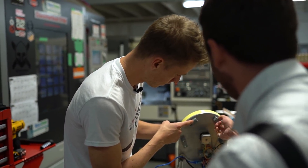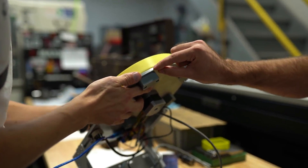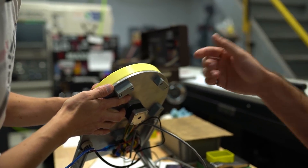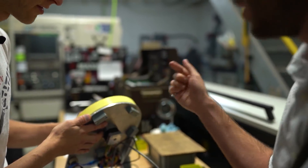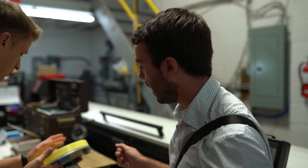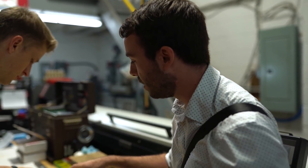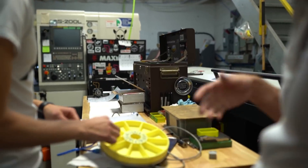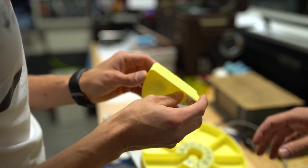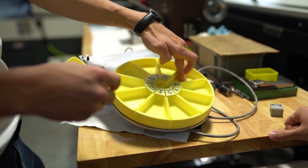So what are these again? These are bearing mounts. They hold very common 608 bearings — just like a skateboard bearing. And it just supports all the outside. There's five of them spaced around to hold it, because these are going to be loaded with your parts, densely. It could be filled with stuff and it could be off balance as well, so anything holding it along the outside, you put quite a bit of weight on there.